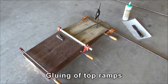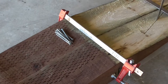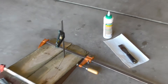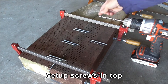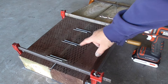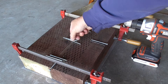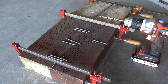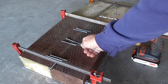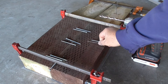I've got a couple of these short ramps set up for gluing. I put some glue on and spread it with the putty knife — these are three of the locations. I'm going to put a fourth one up in the ramp. I'm using the big drill to start with, just to drill a little hole where the head's going to go. These are going in at about a 45 degree angle, so I drill a big hole just to get them started, then use a smaller drill matching just under the thickness to make it a bit easier. I'll drill at 45 degrees as far as it will go, and that'll help start the tapping process.